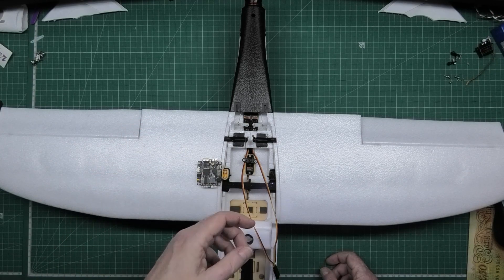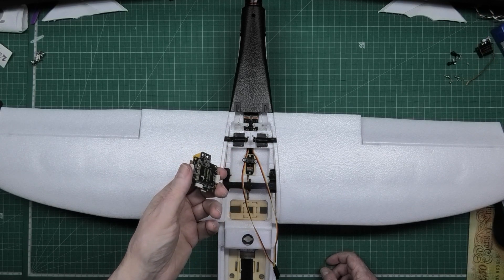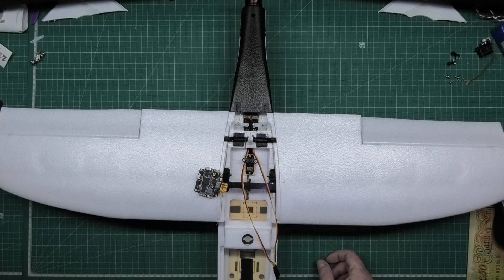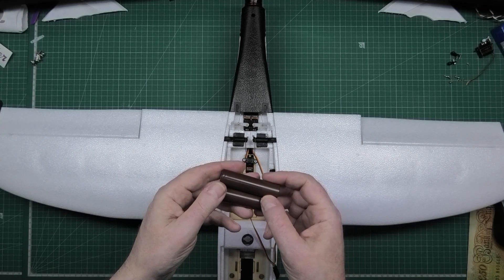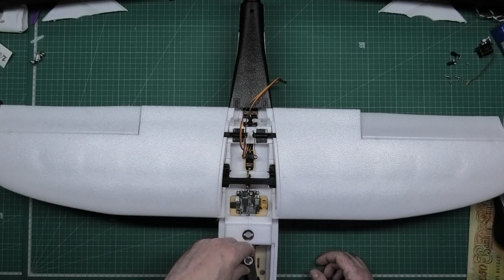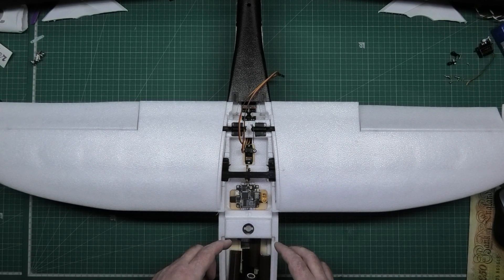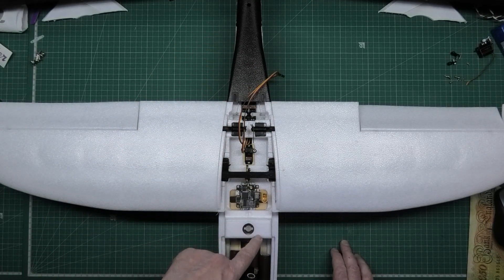With the GPS that's a fail-safe — if I hit the fail-safe switch it'll fly back to me and then I can land it. I prefer to land it myself because I've seen bad things happen — landing in trees and God knows where else. For the battery I'm going to make one out of LG HG2 18650s — a 4S pack. I've got to get the center of gravity right so I'll use the batteries to balance it, and I need to figure out where to put the GPS.